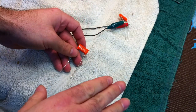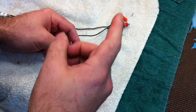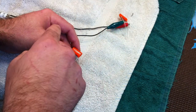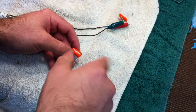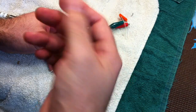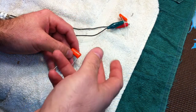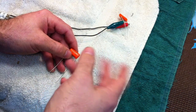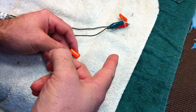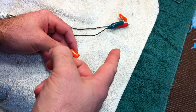I'm just going to put a little PSA out there. If you use an electrolytic capacitor and you wire it inappropriately — that is, you wire the positive end to the negative and vice versa — they have a tendency to explode like firecrackers and throw acid all over the place, including possibly into your eyes. It's nasty, it's very dangerous, so don't do that. They're not really good for guitar work, so don't use them in your guitar. They will not do good things.